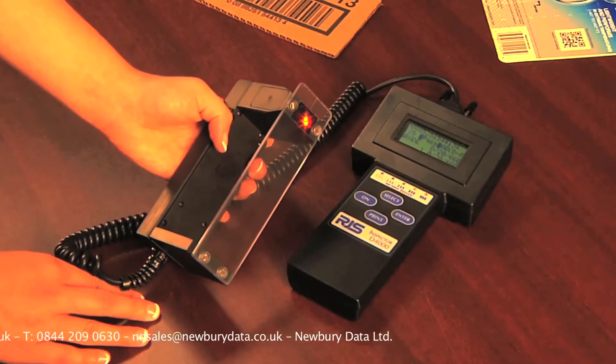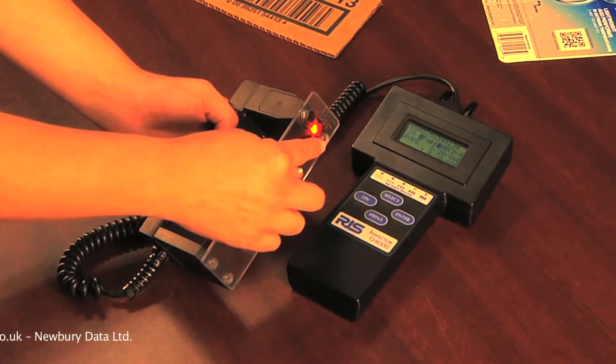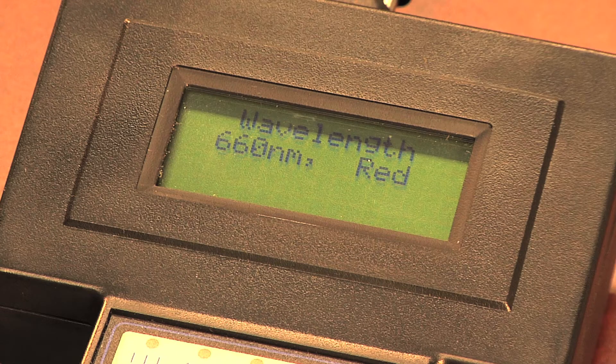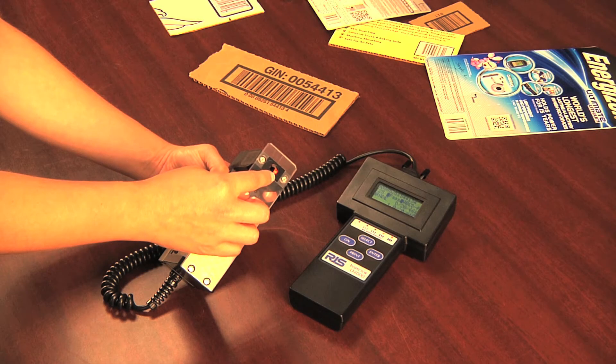Looking at the underside of the unit, you can see two lights. Most likely, one will be glowing red and the other will look to be off. The one that looks to be off is actually an infrared light source and is invisible. Should both lights appear off, check your settings and ensure the wavelength is set to 660 nanometers. Looking straight down into the unit, you can see the lens that focuses the light on the sensor that measures the barcode.